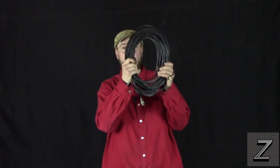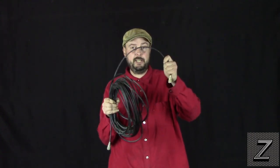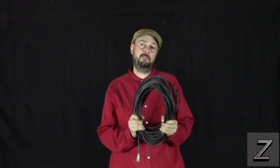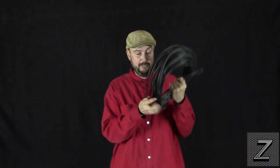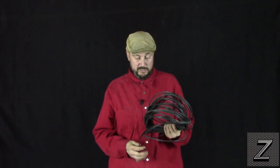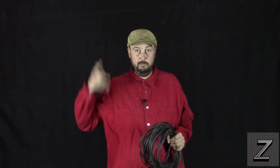If you're on the ground and running 30, 40, 50, or even 100 feet of coax, you're going to want the 50-ohm thick cable — it's about the thickness of a pencil. Don't skimp on your coax. It does make a difference. The cheaper and junkier coax you use, the more dB loss you'll have, which affects your gain — how good a signal you can pull in. The cheaper you go, the less you're going to hear. Go with the good coax; the stuff lasts for years.